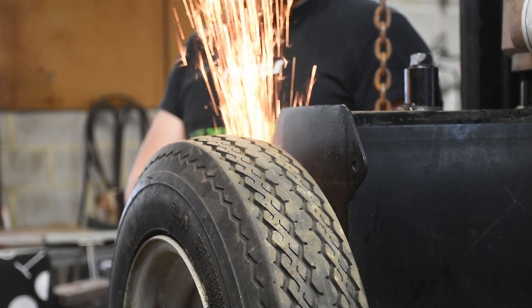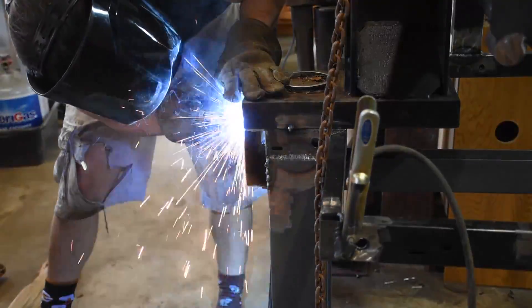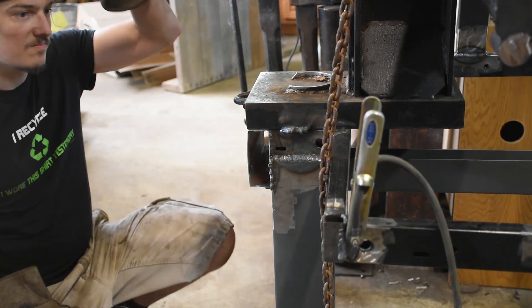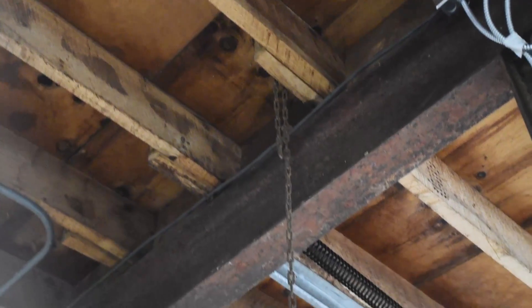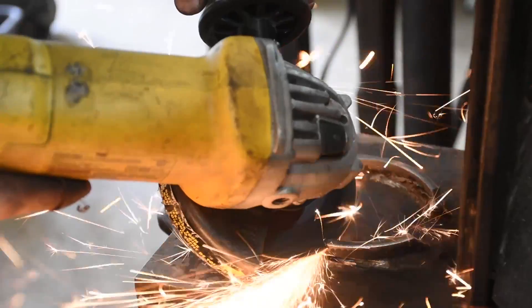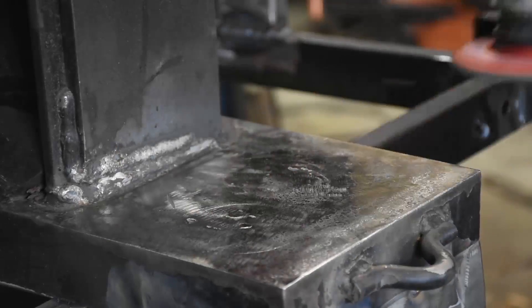It's really heavy. And who knows — maybe I'll use these tires for something else, build a small tire hammer or something. That'd be fun. I was debating with myself about welding versus bolting, but I just didn't have the time or materials to really do it right with bolting, so I just welded it. I've taken the chain fall off and left it fastened to the ceiling instead with another chain. With as top-heavy as the machine is, I think it's actually a very good idea to have a safety line attaching it to the ceiling or wall. On to cleaning off these little bits here — I think those are for holding the log in place — and cleaning the surface so I can get the die stack built up.